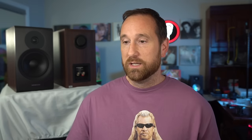Around that 600 to 800 hertz region, we have about a plus 3 dB peak followed immediately by a negative 3 dB dip. The peak didn't really stand out to me — what I heard was that dip, and that's where I felt the lack of thwack, that slightly muffled sound on snares. The data shows what I heard because I wrote down 600 to 800 hertz — it's right in that region and it makes sense.